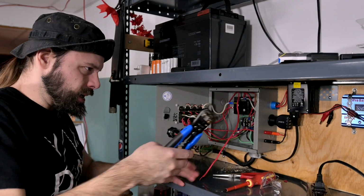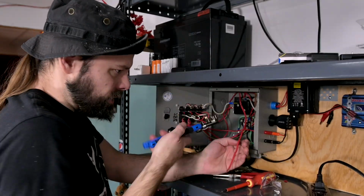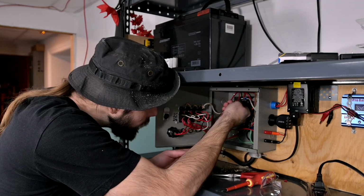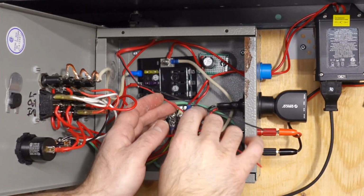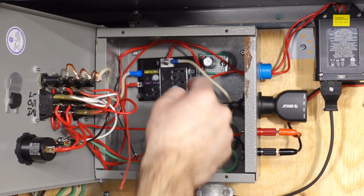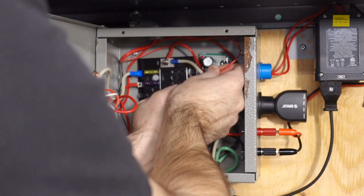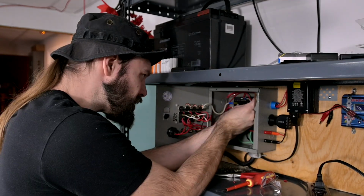What if maybe I could, let's see here. Oh, okay. Just have to massage it out now. All right, so ground and power, bend it off over here. Ground's got to come down to this luggy situation. So we'll just kind of tuck this down here. Positive, I'll use one of these terminals. We'll come back around here like this. Oh, look at that, just enough room. We will splice on a spade here. That's ready. We'll just give it a general routing.